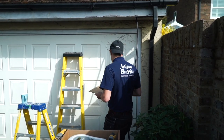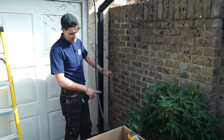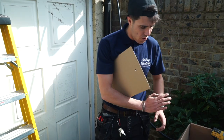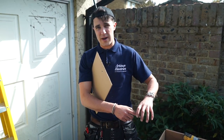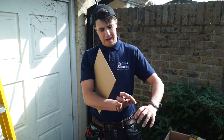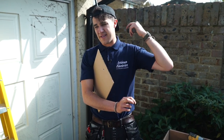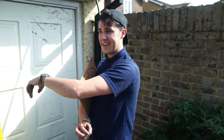So we've already got the cable through and into place - we're just about to mount it here on the wall. We've got the EV Ultra cable. It's a cable that's made by Doncaster Cables. Basically it's a 6mm 3-core SWA and it's also got a shielded Cat5 cable in there as well. So we need that to do the CT connections, because I think it's a little bit too far to get signal over to the Harvey, which will be monitoring the incoming supply.